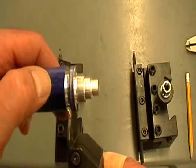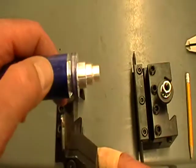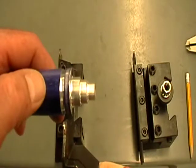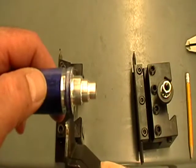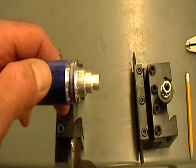Another important thing when using a grooving tool or a cutoff tool: you only plunge in on the X when you're cutting — you never go side to side. That is not good; you'll end up breaking the tool and ruining your part. So once you have your tool set to the Z that you need, whether it's for cutting off or for grooving, make sure you just plunge straight in on the X and then straight back out.